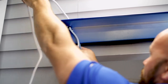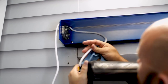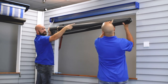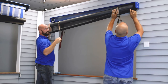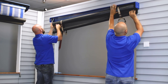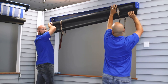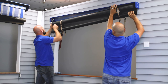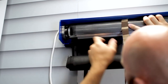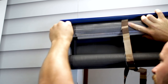As you get close, take this end and have your partner go to the idler end. He inserts the idler end first — it's spring-loaded so there's play to go back and forth. Make sure your partner keeps his hands on it at all times so it doesn't come loose. The motor cord has a little slot that has to be pushed all the way in with the yellow cap closed, then feed it up in there, take your spring clip, lock it in, and it's installed.